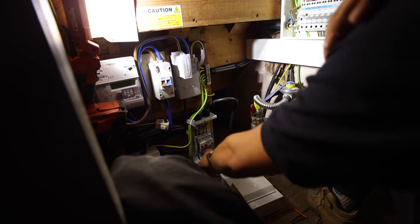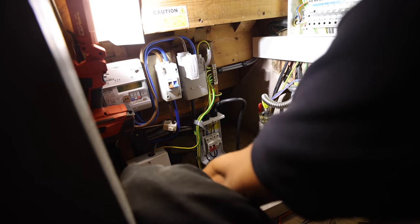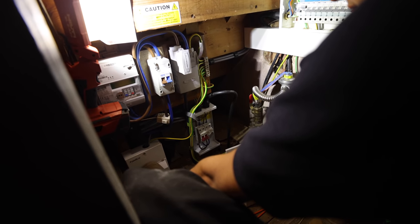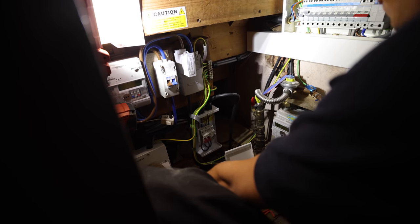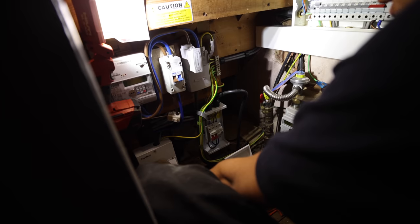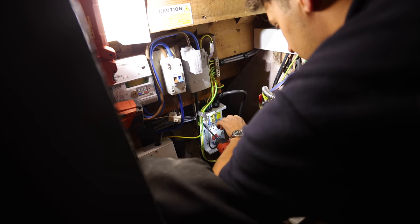This is the old circuit which was powering the Tesla charger from the last episode. It had type A RCD protection but didn't have PEN fault protection, and it is TN-CS. So either I put in an earth rod and go through the hassle of that, or I can just put in PEN fault protection. The downside to the Tesla chargers is they don't have that built in, so I've got this GARO unit here to replace this one. Unfortunately this board isn't quite wide enough to fit all the stuff in — I want to get this swapped over as quick as possible because it's seven o'clock now.